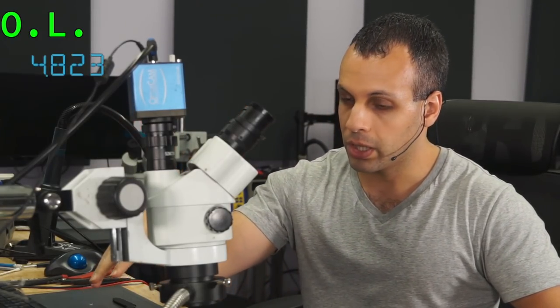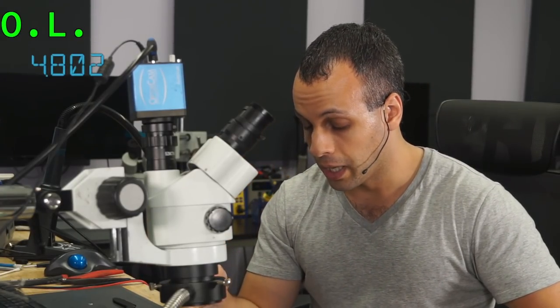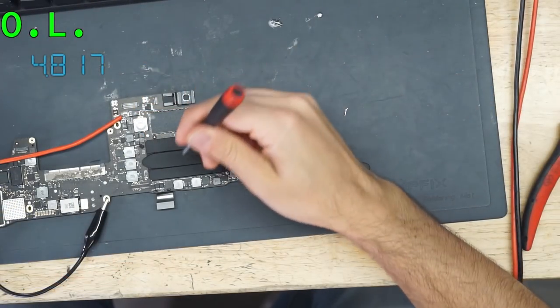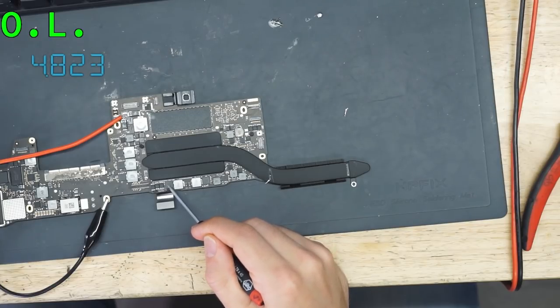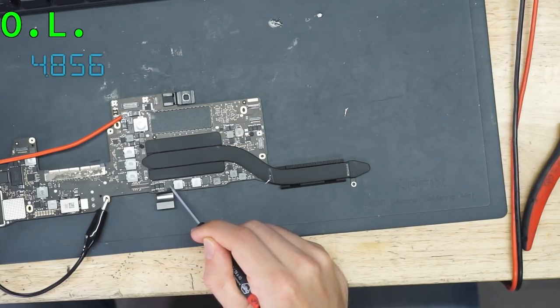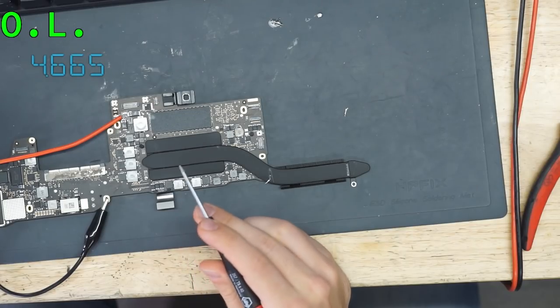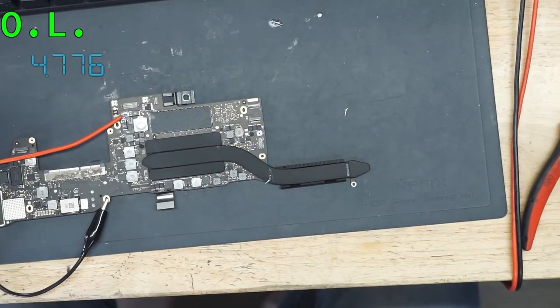So if you were to just send 12 volts into the system right now, and the short circuit was on one of these transistors over here that sends power over to the CPU, if this was broken and stuck open or closed and sending things everywhere, you would actually wind up sending 12 volts to your CPU.